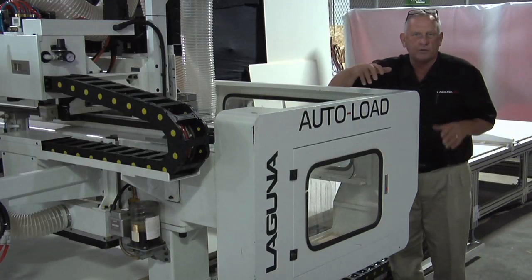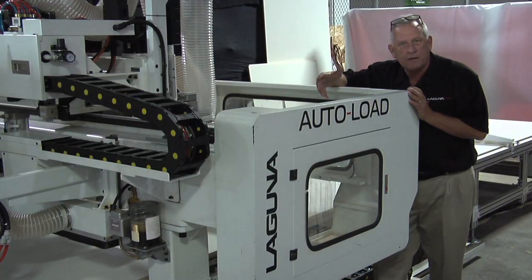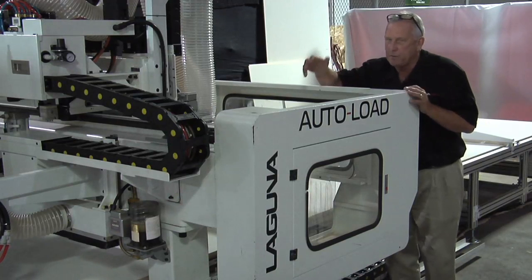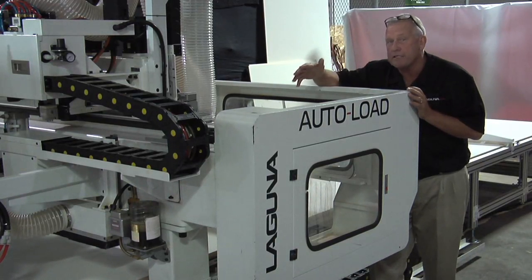The whole concept of an autoload for a CNC router is about why it makes sense and why you may need it. When nesting was originally introduced, the savings came because the load-unload ratio was very low compared to cycle time — and that's true. But another factor is worker fatigue. A worker starts out fast in the morning, but by mid-afternoon it takes much longer to load and unload. When a worker gets tired, the cycle time and load-unload time become about the same. Autoload cures that problem because the machine controls it — it's about one minute between panels. That's not a variable of a worker anymore.